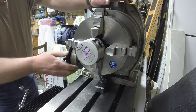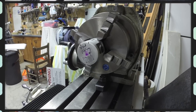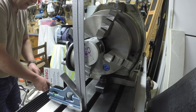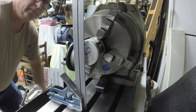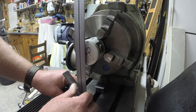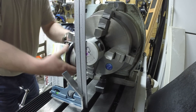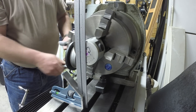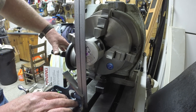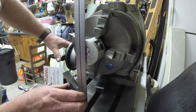Now I've got my rotary table disengaged so I can move it around by hand, and I'll get it close. I'll use my square to locate the first edge — I have to bring the table down a little bit so it'll clear. I'll engage the worm gear so I can turn it with the hand crank. I've got a little mark right in the center that shows me the center of the workpiece, and there's a mark up on the edge where I'm going to start.